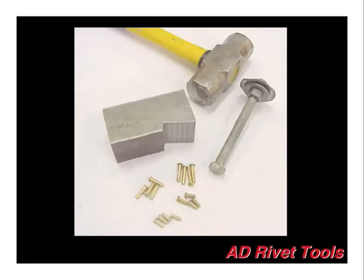Since day one, SONIX aircraft has used these simple and inexpensive riveting tools to install all the solid rivets on our aircraft. The machine bucking bar provides a notch to clear the SONIX bar cap and is a tool SONIX aircraft sells. Note that the only solid AD rivets in SONIX construction are a few hundred in the main spar build-up, where access to both sides is easy. The other tools are a medium-sized 2 to 5 pound sledgehammer and a large bolt with a polished head to serve as the setting tool. This riveting method provides a great deal of control to the builder, and if done correctly — meaning you're not working too hard — it is extremely simple for any skill level. This method represents a huge potential savings, replacing hundreds of dollars of solid riveting tools with a setup that costs less than $50.